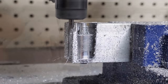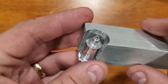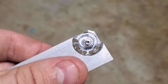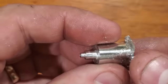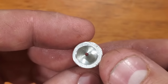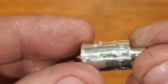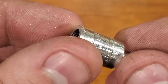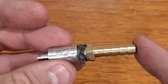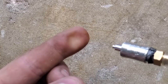After about an hour of very sketchy slot cutting on the CNC, I was the proud owner of this little aluminum nozzle insert — well, almost. I left a little material behind so that the part didn't snap off my tool, so I had to drill those bits out and cut the rest of the way with some snips. I also didn't think ahead when I designed the part, because I should have had some flats to hold it in a vice when I tapped it, or at least tapped it before machining. Cutting threads for a 1/8th NPT required a lot of torque and I mauled the pretty finish on the part pretty bad. But I did end up with a functioning nozzle insert that I could connect to an air hose, so I guess it was a success.